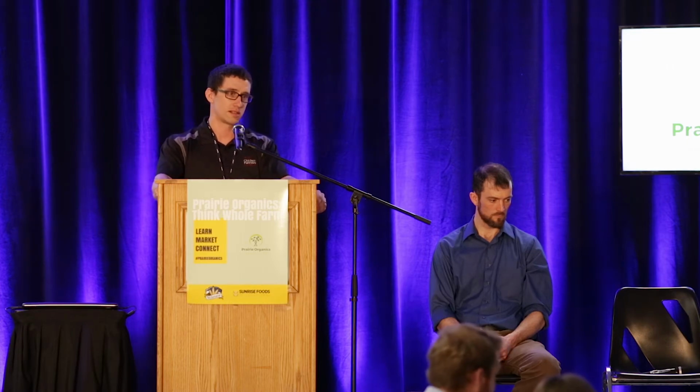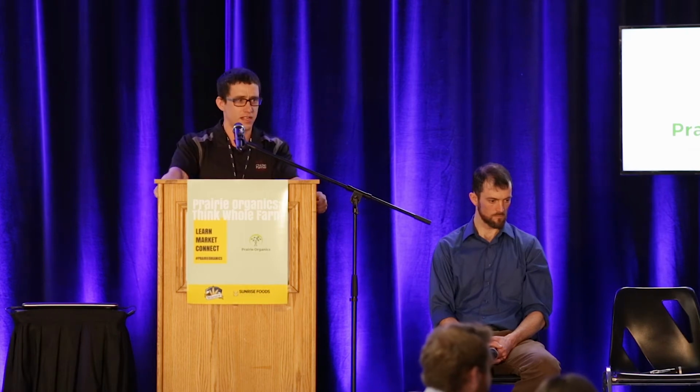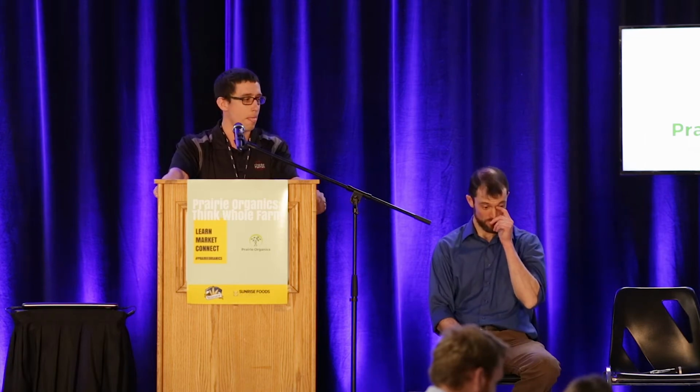So I thought, hey, maybe I can power this a different way. Sure enough, I found a hydraulic motor, sized it appropriately to the flow on the skid steer that we had, and hitched it up like that. And then I went and modified the frame so I can pick it up and move it around with the skid steer. So that's my mover. It's been real handy because it's very reliable. We keep the skid steer inside, so it's going to start. And that's a machine we already have. I know the skid steer is not a cheap machine, but it's something we already have for the boiler operation. And also the reversing hydraulic, so it's easily reversed for cleanout and things like that.